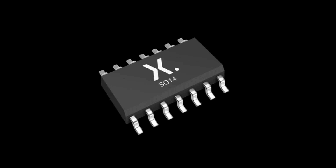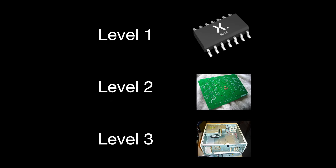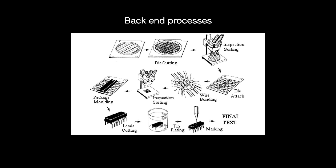This whole setup is considered by the industry as only the first level of semiconductor packaging. The second level refers to the circuit board, and the third and final level refers to the system's final enclosure, like the desktop PC's chassis. The process of encasing the fabricated die into its level 1 package is referred to as the back-end. We can further break down back-end processes to two major steps: assembly and test.